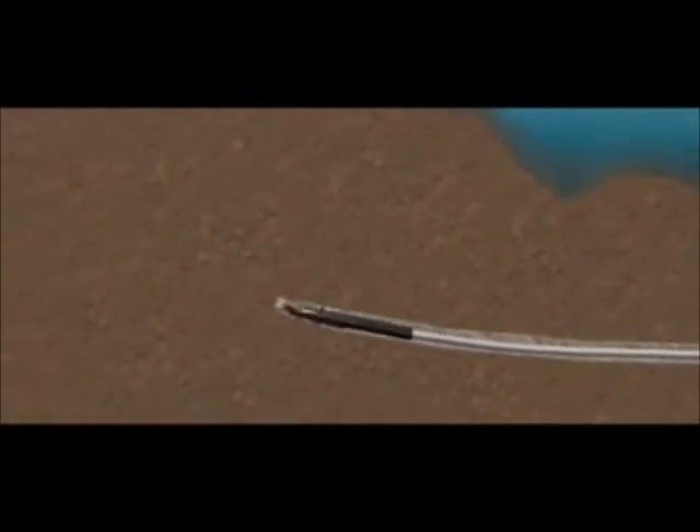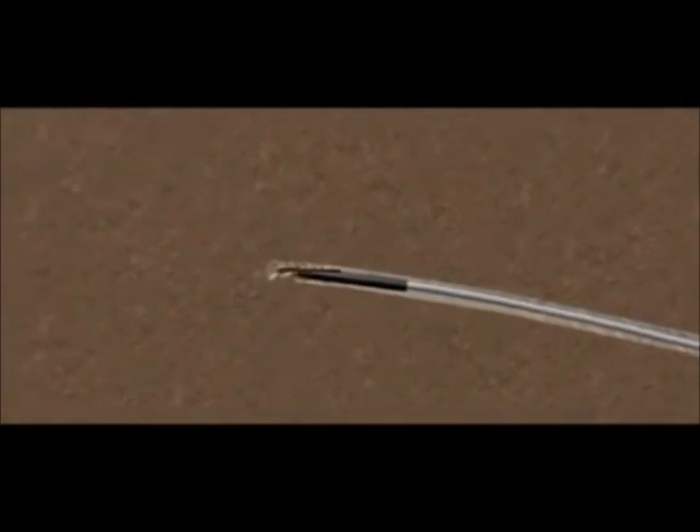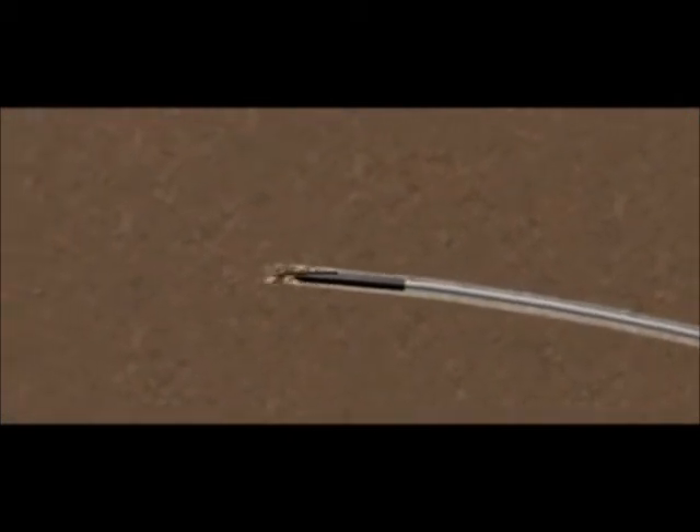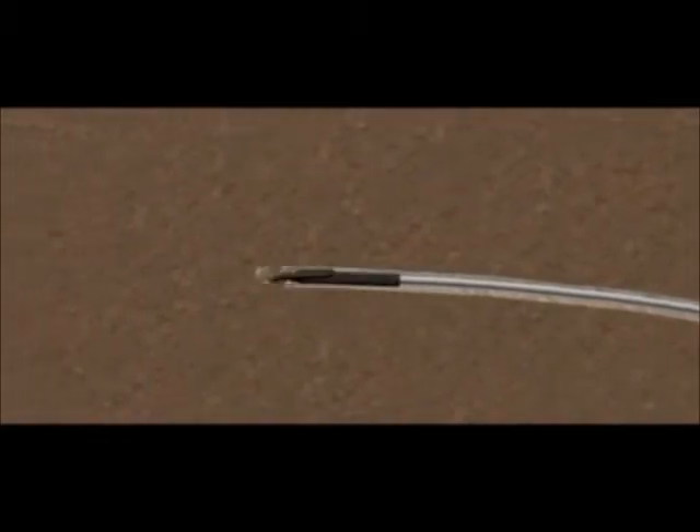To achieve the line and depth, the pitch and roll are calculated and controlled by using either walk-over tracking, magnetic guidance — also known as wire line — or gyroscopic steering. If ground conditions allow, shallow single gradient drills can also be achieved.